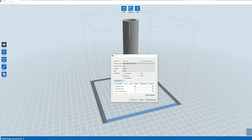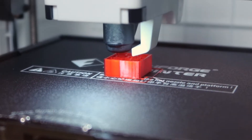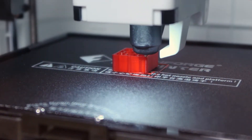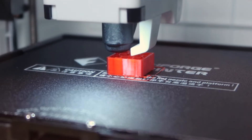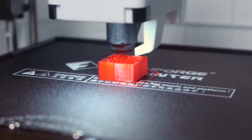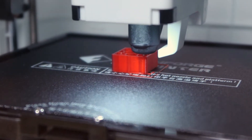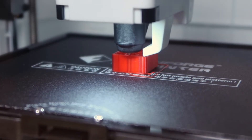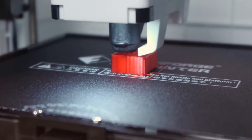Occasionally I have heard popping — there's a popping sound that happens. That's sometimes because the extruder is too low, so the hot end is actually touching the bed and preventing the filament from extruding properly. Calibrating sometimes has to be done if that's an issue. If you keep hearing that popping and the filament isn't pulling up, it means it can't escape somewhere. If you don't have a clog, you probably have a nozzle or hot end that is not calibrated to the bed height.